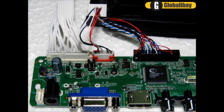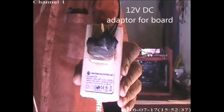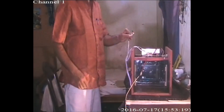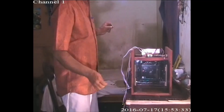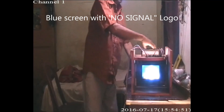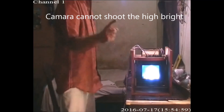This is called the LVDS cable. The backlight connection does not need to be connected. Supply a 12V 2A adapter for the universal LCD board. Once connected, the indicator light turns from red to green, meaning power is on. The backlight shows the picture on the LCD panel — you will see a blue background with a 'no signal' logo.